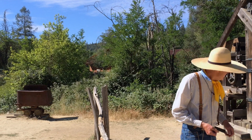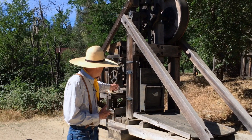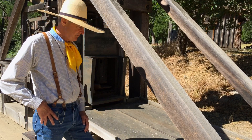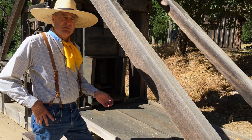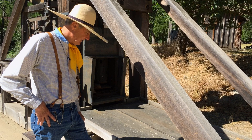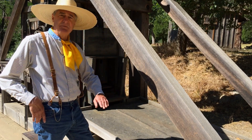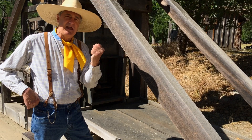So we're going to crush the gold to this very fine particle size, and when it gets to the point where it goes through the screen, it flows down this table right here — this amalgamation table. What this is, is a sheet of copper that's been painted with mercury. Mercury sticks to copper, and a lot of metals stick to mercury. Gold and silver certainly do. So when you paint this with mercury at the start of the day, it'll be a flat sheet — it'll look like a mirror surface. And as it collects gold, any particle of gold that touches that mercury, the mercury will just pull it in and hang on to it.